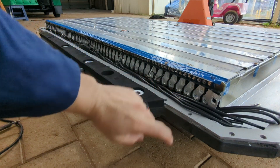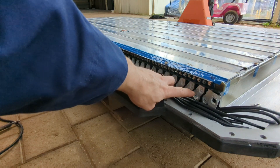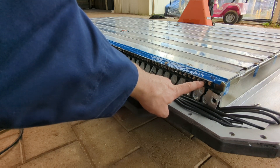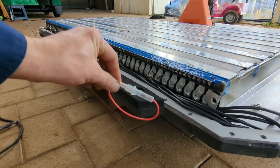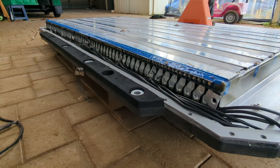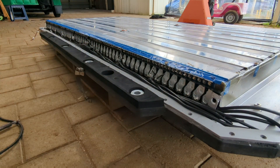For all the cell taps, I'm putting all the BMS cell taps down the far side of the battery. For this side, I'm just going to make use of these terminals that they've run across the top of the internal of the cells here. They've run across the pack, so I just need to solder each one of these bus bars to one of these corresponding internal cell links. I'm planning on putting some fuse holders in between the bus bars and the pass-through links that go to the other side of the battery pack, so all my BMS leads I can pick up from the far side without having to run them down this already very chaotic side.